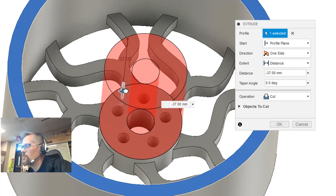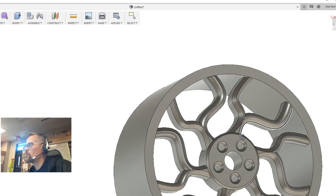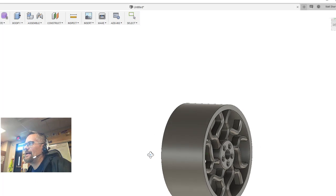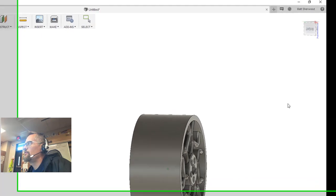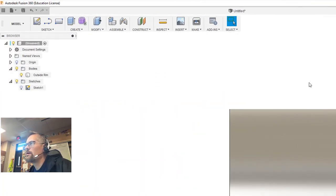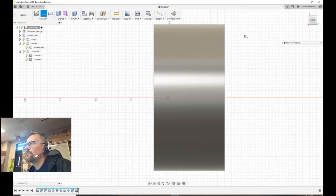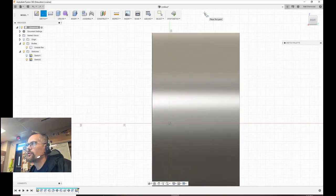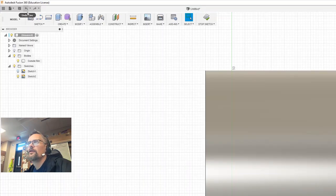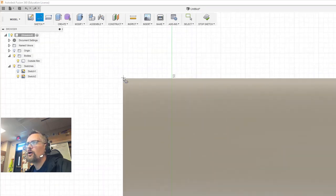It possibly would be a little beefier than that, but I wanted to see those holes so people could make them visible. So now we've got the rim, we've got the spokes, we've got the inside done. The next step is we need to make that barrel — we need to put the edges on it. So we're going to rotate to a side view on this. I want to be looking at this side. Now, if you didn't make your rim from the origin, this is where you're going to have a problem — you'd have to put in some construction planes to make this work.